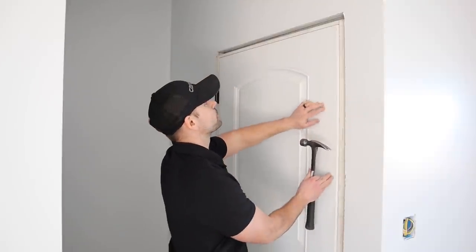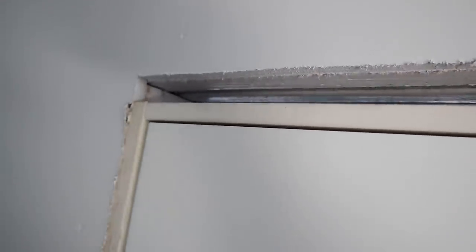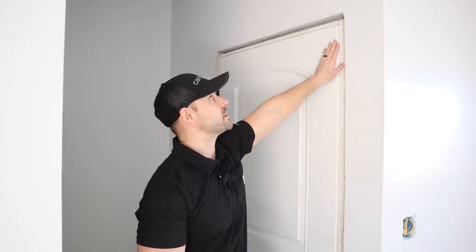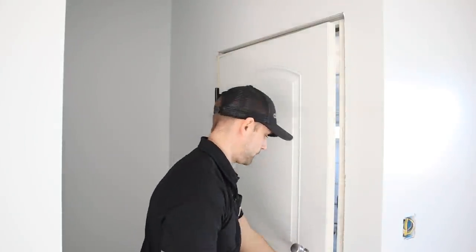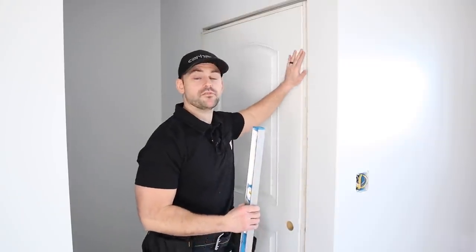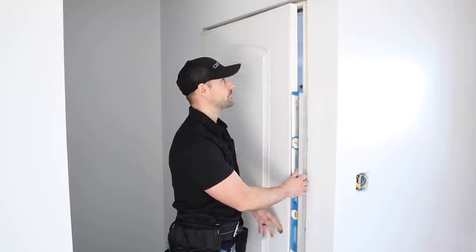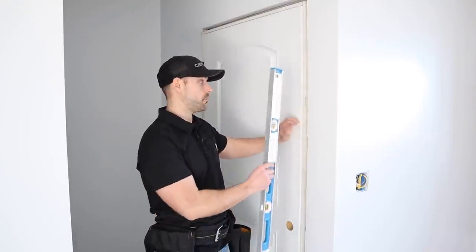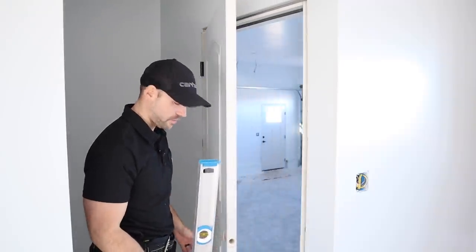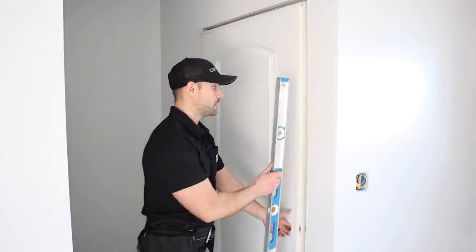The reveal up here is a little tighter on the latch side than on the hinge side, and that's actually what you want. Over time the door will settle, and the doorknob side tends to drift down. If you set it a little high to begin with, it will sit level after settling. Now we need to check the hinge side for plumb in the in/out direction — if the door isn't plumb that way, it will want to swing open or closed on its own.